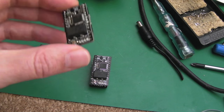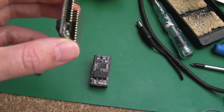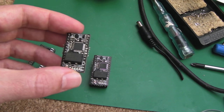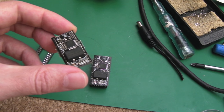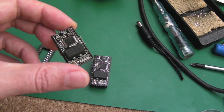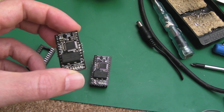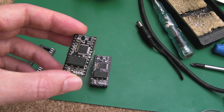This outputs a full 3-volt peak-to-peak output for the sound output without a 1K load, so apparently that's the same as an 8580. Improved filter quality, 16-bit with a resonance table for both SID models, which is quite cool. Improved waveform calculation, full 16-bit, high resolution combined waveform tables.